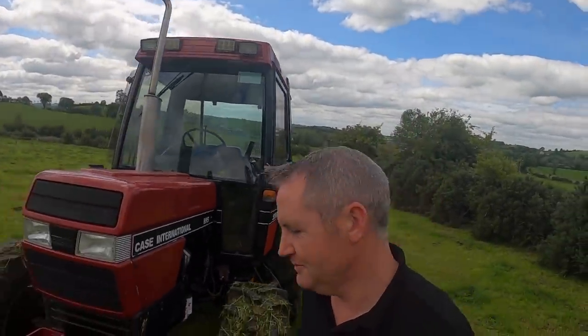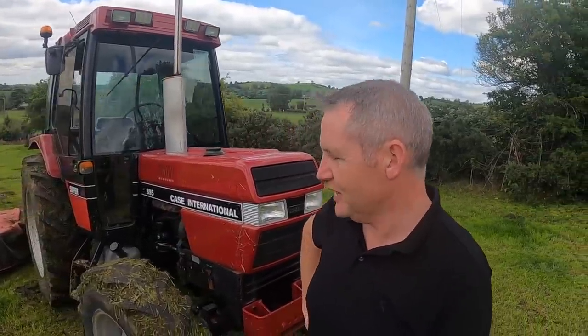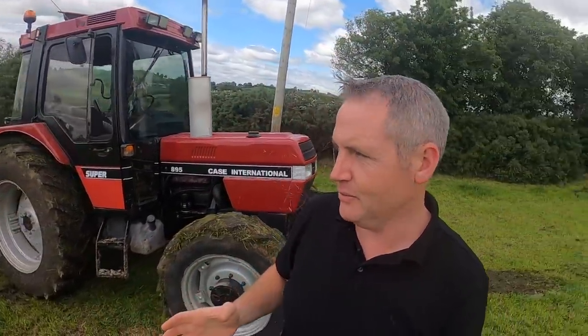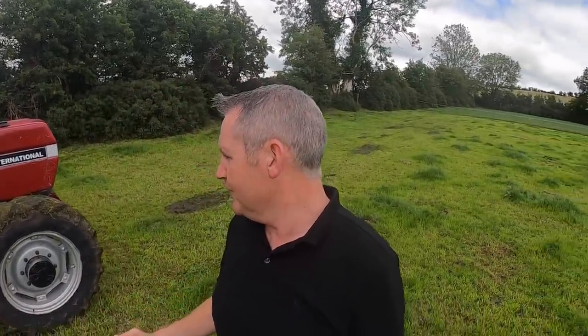Okay, we are back in action. We're solved. We got her moving again. Well, I'm just after starting. I haven't moved her yet, but I'm just after getting her started there. I couldn't film what I had to do because I was covered in diesel. I've actually been back and forth home on the quad a couple of times. But basically, a 19 spanner is all I needed and a bucket. Simple, very simple fix, but it's something I never knew anything about. She was airlocked.